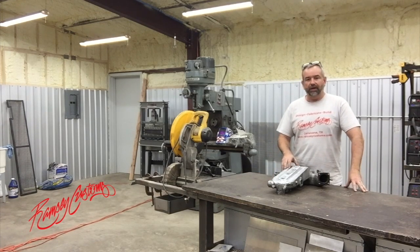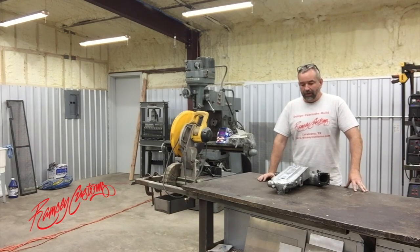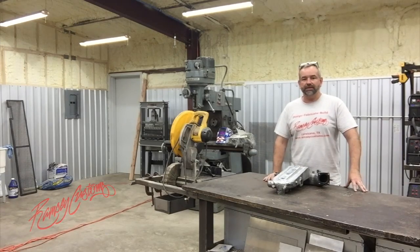What we did was they had already cut the top off of it. We did some milling and milled out a lot of the inner structure. Made a custom new top to go on top of it, and some drilled and tapped for some 3/4 inch NPT pipe plugs to allow access to the bolts. So this week's video, we've got showing you the entire process.